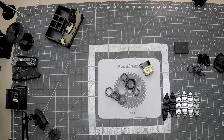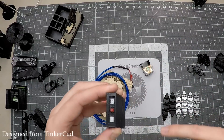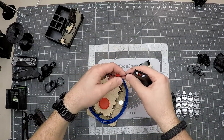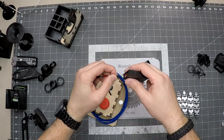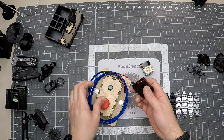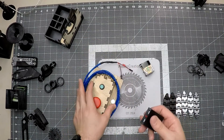While we're on production stuff, here's another one — this is a little tiny box. You'll see two pins and an LED. Inside I've got a battery and some wires that run to it, so I can test these buttons to make sure they properly work before I send them out. I'll put these on the pins, push the button, and the light comes on. That means the wires are good — the solder job and wires all have good connection. So that one's safe to ship out.